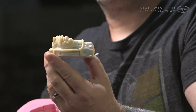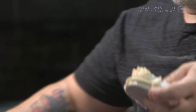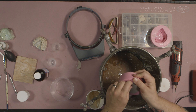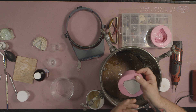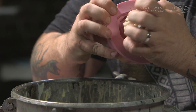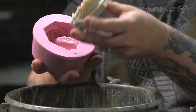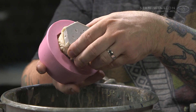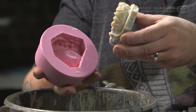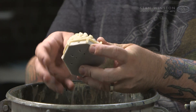They turned out good — that's the first part. I'm going to open up the next one. Same thing: pull it around, check the flash. Since I know it's the same batch, it's fine, but it's a good habit to get into. When you pull them out, make sure you don't bend and rub the teeth up through the mold — they should come straight up and not at a weird angle. These look good as well.